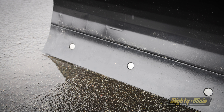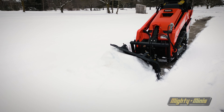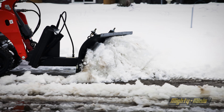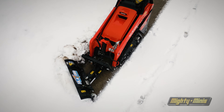The blade is built around a hardened, reversible, and replaceable cutting edge designed to get the most life out of your investment. An enhanced engineered moldboard mounts close to the front of the unit for an effortless and natural rolling of the snow, while reducing leverage and sliding to combat wet and sticky snow for an optimized, efficient push.